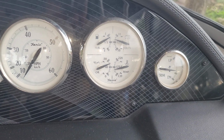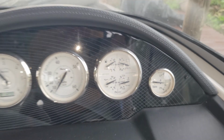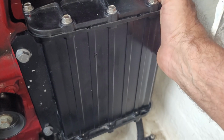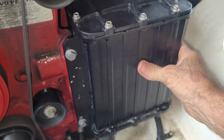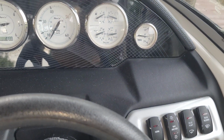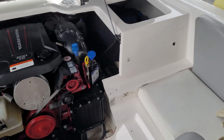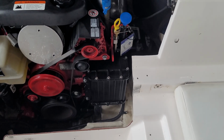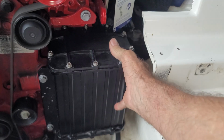So far so good. We've had it running for maybe 3 to 5 minutes, and we're well under the 175, which is good. The other good sign is that the heat exchanger is cool to the touch. Before, after 5 minutes, we would go over 175 if the drive was in the water. And the heat exchanger got so hot to the touch that it took several hours. I had to wait overnight, basically, to come back, which we had to come back for the part anyways. But I had to wait a long time to be able to even work on it.